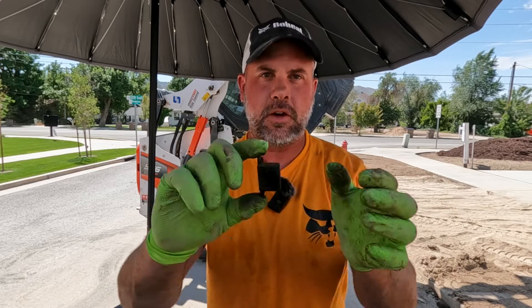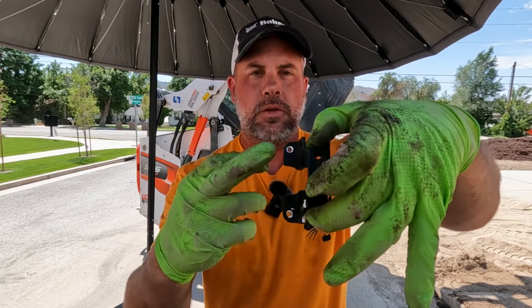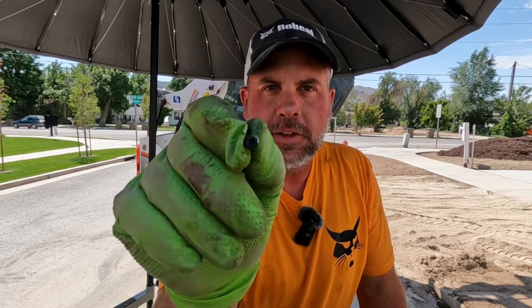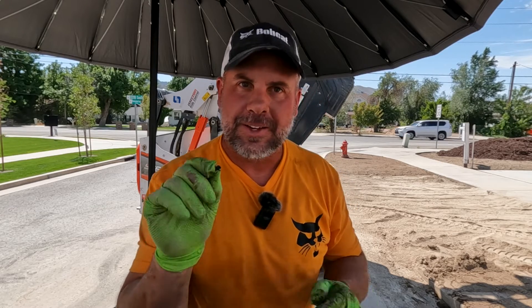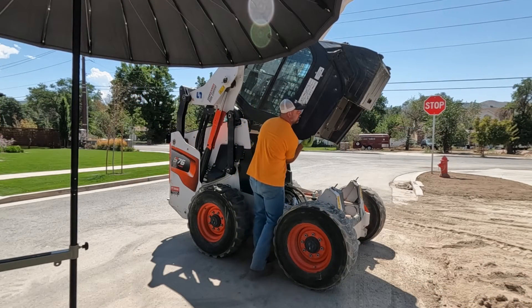I've got the swash plate sensor off. On top of the sensor is a bracket that goes over the top to protect it, with two screws coming in from the side. The right side sensor is much easier to access than the left. These 2.5 millimeter hex head screws have paint inside them, so you have to be careful to seat your allen wrench properly so you don't strip them out. Your kit does come with new screws when you buy a new sensor, but make sure you can get the old ones out first.